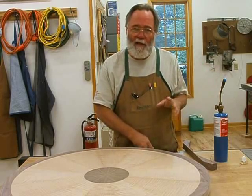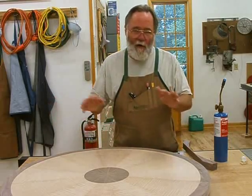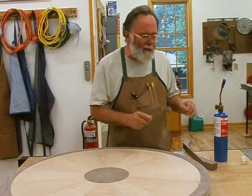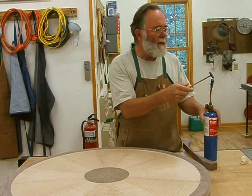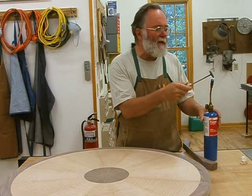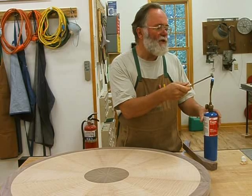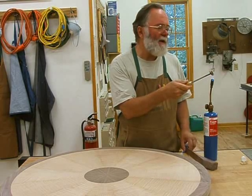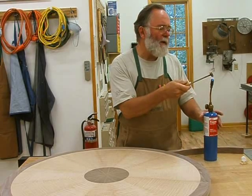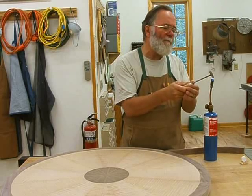You heat it up with a torch. This is the only time I ever allow an open flame in the workshop — when I'm heating up this brand — and notice I've got a fire extinguisher nearby. I keep the rags and everything all away from this just to be on the safe side. You have to heat this until it changes color. I go ahead and rotate it through the flame to keep the heating even. After a while you'll see it start to change color — it's starting to get a little bit of a bronzy, coppery look. I'll see some blues here in a minute; that tells me we're getting close. I've got a piece of scrap wood here that I'll practice the brand on to make sure I've got the heat right. You don't want it too hot or it will burn through the wood.